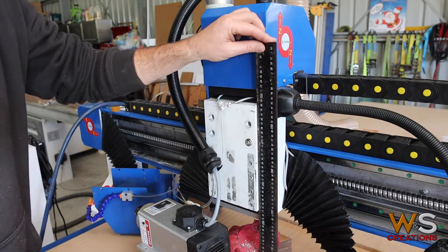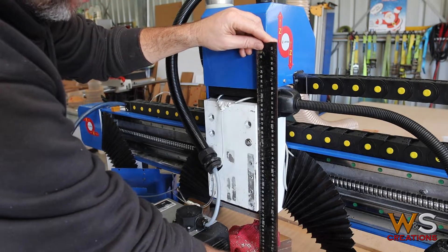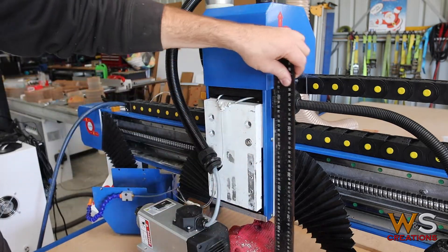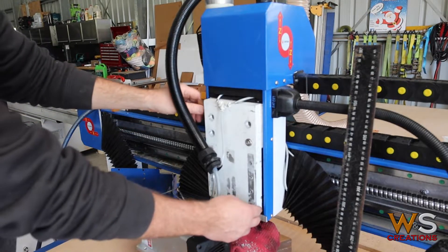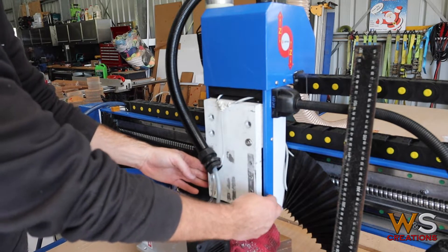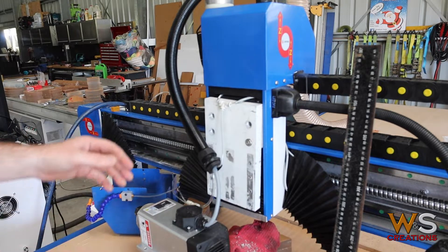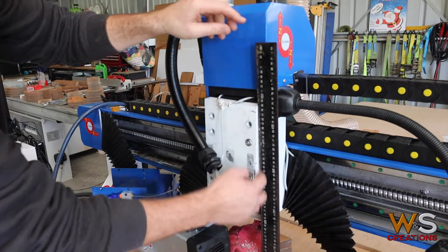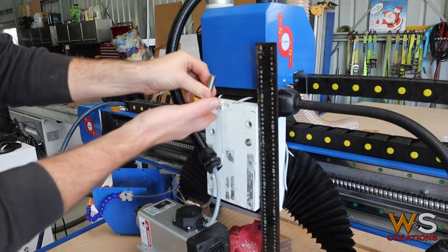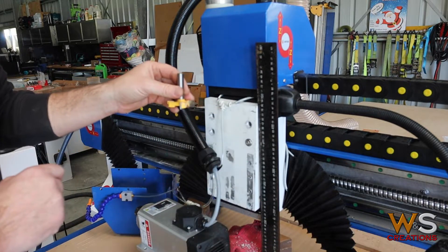As you can see, I've got a plate square running along my spoil board, which is relatively level. I've got it hard up against there — that's where it should be, nice and perfectly perpendicular with your bed. By eye I can still see it's out a little bit to this frame. What it was, was out like this — there's a gap there at the bottom and not at the top. When you've got a bit like this, it tends to lean, so one edge is scraping more than the other. That's where you get your grooves from, which I'll show in the spoil board very soon.